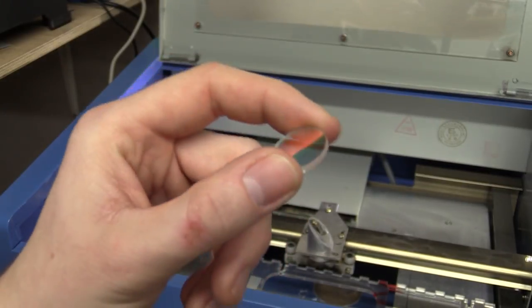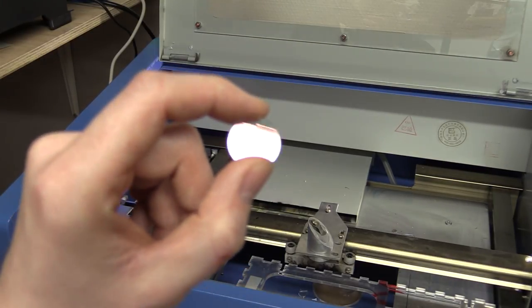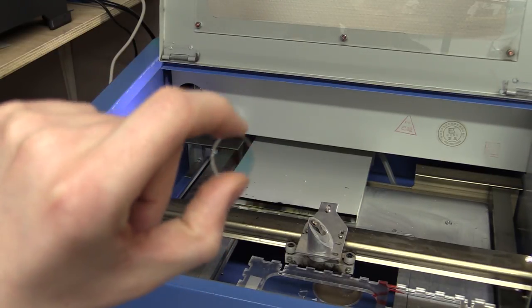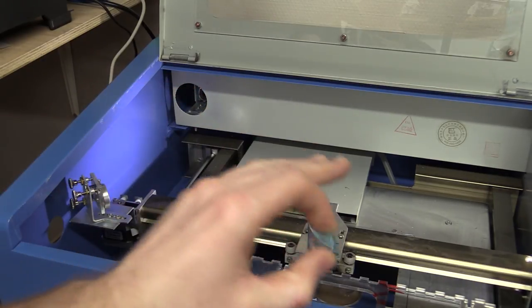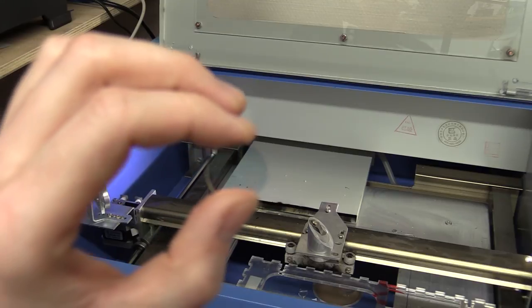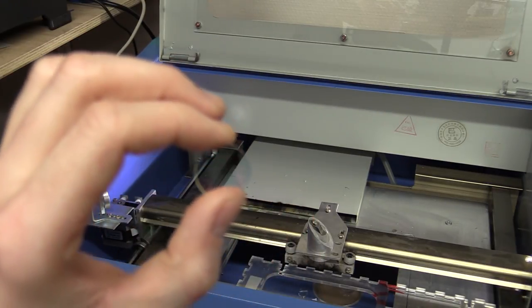So they are just a bunch of assholes — the guys that sold this to me — because it was sold for this exact purpose: to use in a laser cutter to combine the beams. But there is no way that is going to happen if the backing is just regular glass, because no infrared light at this wavelength will go through. Unfortunately it was so long ago that I can't really complain about it. So that is how you waste 15 bucks in a hurry.